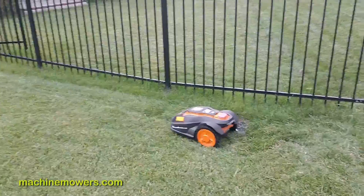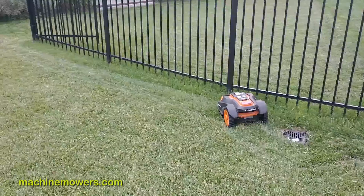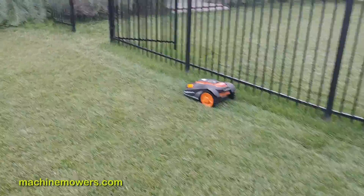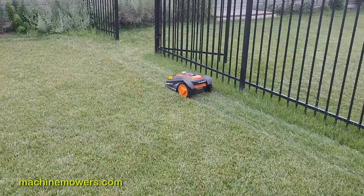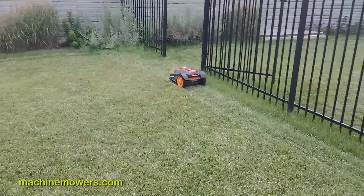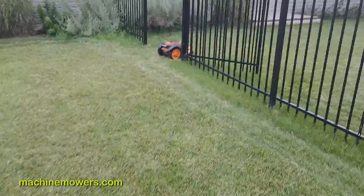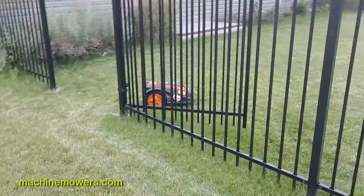That's one negative, but you'd have to do that with traditional mowers anyway — and traditional mowers are more dangerous because the vacuum and power of those blades can spit out sticks. I go out to a lot of properties and see these robots stuck, and the main reason is that some obstacle has impeded the boundary wire path. In this video, I want to make clear that this is a big troubleshooting point you need to know.